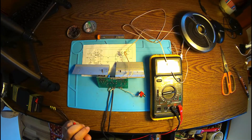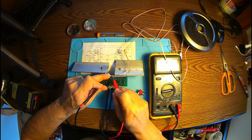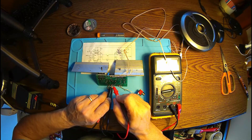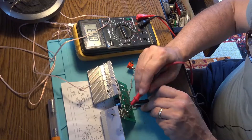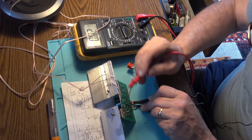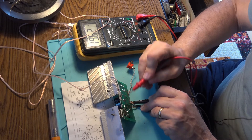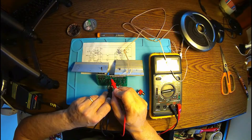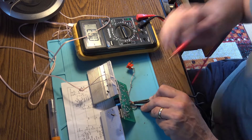But let me see some voltages. We got something here on the loudspeaker — nothing. Let me see. This is the ground. So we should have plus on number 7 and number 13. This is number 7 here — yeah, that's okay. Here too — yeah, this is fine. This is fine too. What else? Out on 14 — and we got minus. Got minus here.